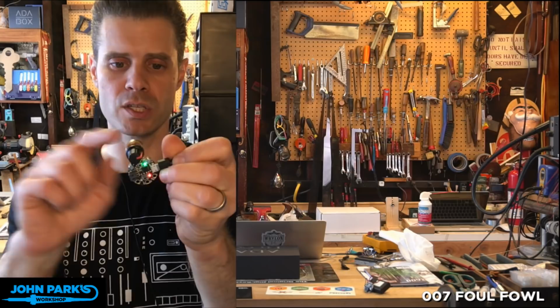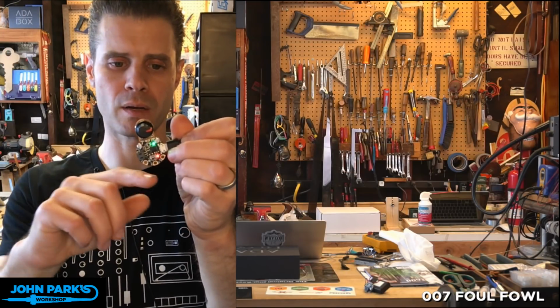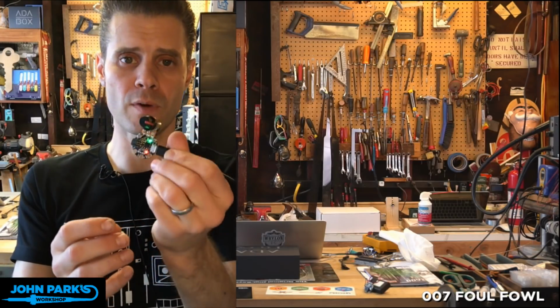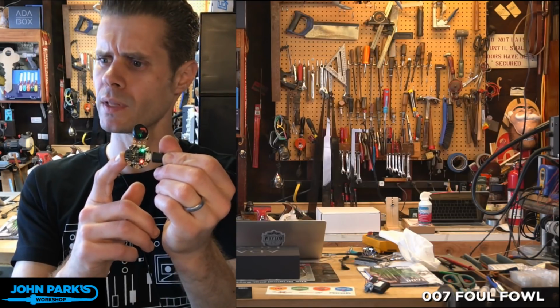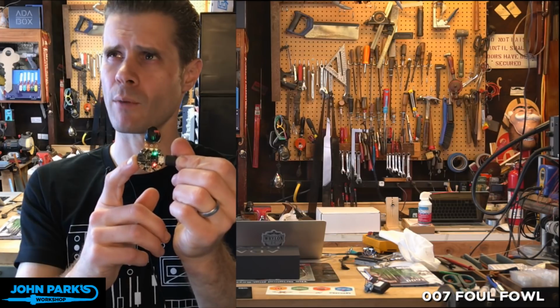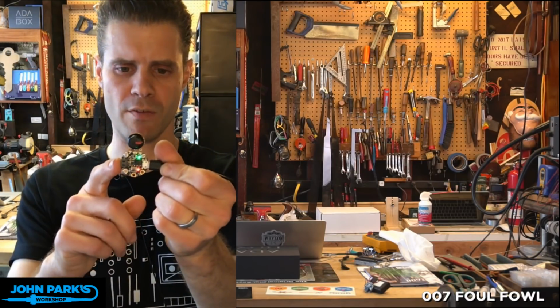It would be difficult to do the same trick here where we have it plugged in without actually running a wire across the ground from one. But since you can read in 3 potentiometers, we got 3 analog ins, right? Am I right? I think we have 3 that work. Yeah, because A0 is funny on output stuff because it's also a speaker, but I think it works as an input. Someone correct me in the chat if I'm wrong on that.